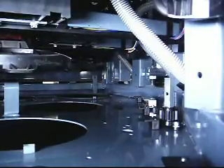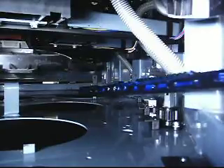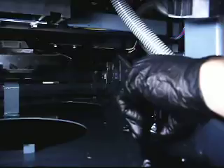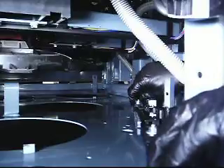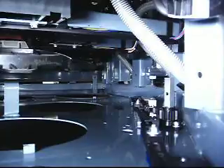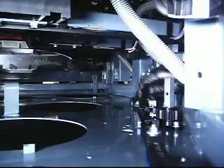We're ready to shove in what actuates the spotting tong switch. You'll notice I've got the lubrication on it. This is important — putting that lubricant on this actually helps you from getting error code 76s. I've done different tests on these pin setters with lube in one spot and no lube in another. This tooth rack has to have lubrication on it. It'll keep it from bouncing back when your switch cluster doesn't slip enough up top, stopping the spotting tongs in their open position so it won't bounce back off of this stop block.